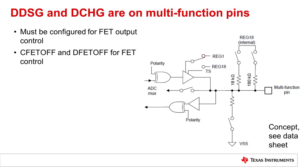For the multi-function pins, there is quite a bit of flexibility. Typically, these can be used for temperature measurement, or for a direct ADC input, or a general purpose digital output, so it is important for the system designer to set the configuration properly.